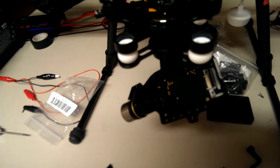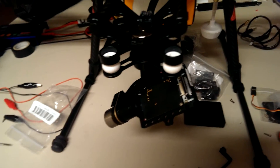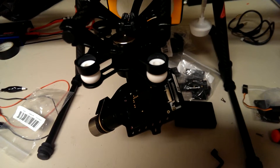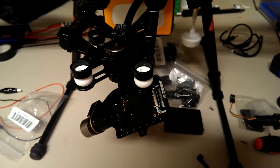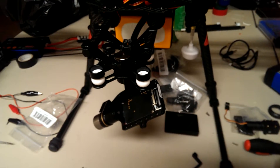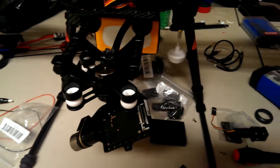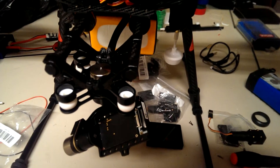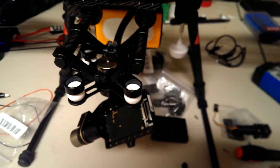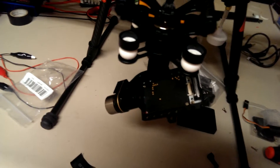It's plastic so it trims away pretty easily. Put the Dremel on a high setting and take a little bit at a time so you don't cut too much. Make sure you do it evenly — you don't want it tapering. Test fit it until you find a nice smooth fitting to your taste. If you want a stiffer connection, don't bother, but if you want a smooth connect and disconnect, I definitely suggest trimming it down.